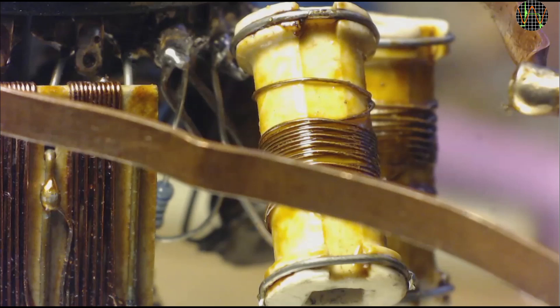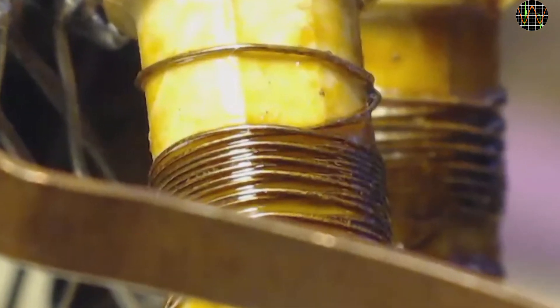Remember the non-reactive claim? If you look carefully, you can see that the wires on the resistors are not just wound like a coil, but cross each other — it is easiest to see on these low-ohm resistors. There is a Wikipedia article on wirewound resistors you may want to look at, link in the description. According to the article, it appears to be Ayrton-Perry winding, producing specially low values of parasitic inductance and parasitic capacitance, used for resistors in radio-frequency applications.